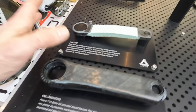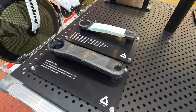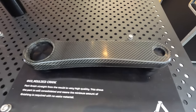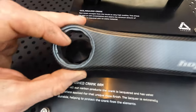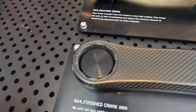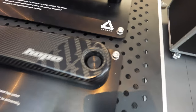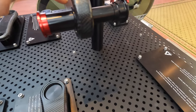The carbon fiber is hand-laid around that foam armature, which acts as a dampener and holds the two ends in place during manufacturing. Hope have actually invited me to the factory to see the cranks being made. Available in April, the crank goes into the autoclave to get pressurized and baked, then it's hand finished. You can see a slight wave pattern to accommodate the crank inserts.